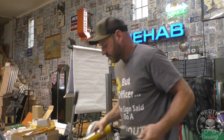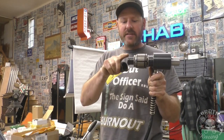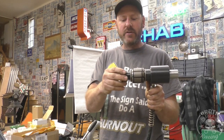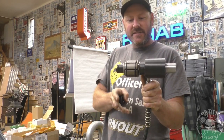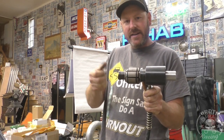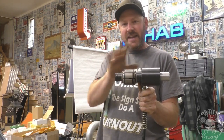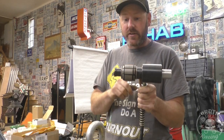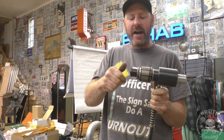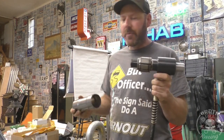So I one-upped it. This is a hydraulic punch driver tool from Harbor Freight. Normally this die would be on there - this is the female die and the male die would draw into it. That stud pulls in as you increase the hydraulics. So I cut this thing, beveled them on both sides so that it would make a rounder inside part, otherwise it's real square because they cut these square from the factory. I cut them down to two inches and did all that. It limits the pipe range you can do because you don't have as much motion, but it works. I had to increase the hole diameter with a die grinder to three-quarter of an inch, and I'm just using the male die as the nut on it. That's actually how I did that flange right there. It works really good - super easy.